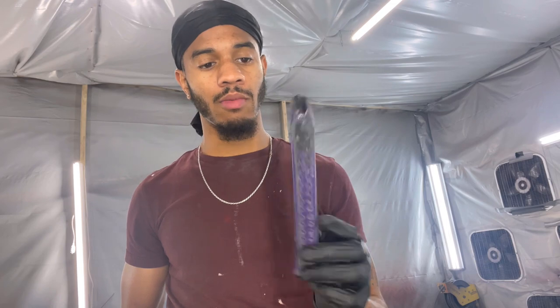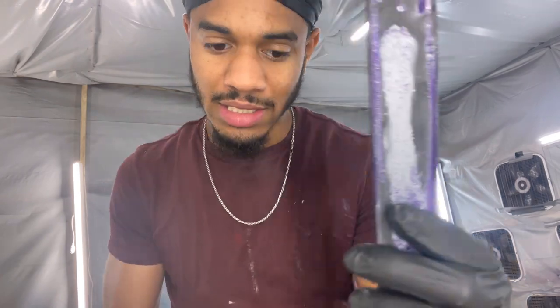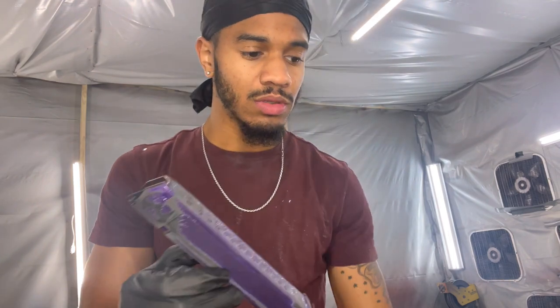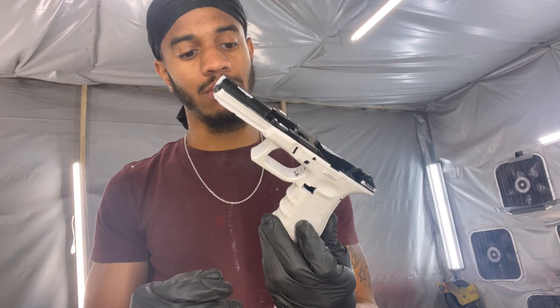And yeah, so we're gonna go ahead and sand these bad boys down. I'm gonna do some 180. And then we're gonna prime it. We're gonna put the primer right on top of the 180. The reason I'm sanding it is because you're gonna feel it, you're gonna see it, it's gonna be noticeable. So I'm gonna sand both these pieces with some 180, then I'm gonna buzz over this probably with some 320 and go from there.